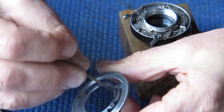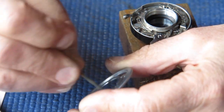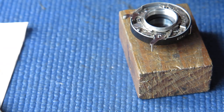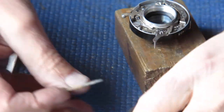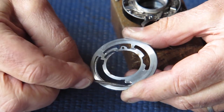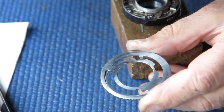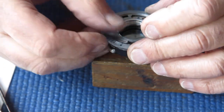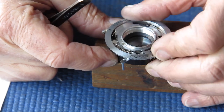And I can put the speed cam ring in place. Before I do that I'll wipe around the center with some molybdenum. I'll run around the cam surfaces where it picks up the pin on the retard gear train. And here is where the high speed spring is under tension at that point, so I'm making sure I've got some lubricant on that. I can lower this speed ring in place, making sure that the B lever here is dropped back into its slot freely.